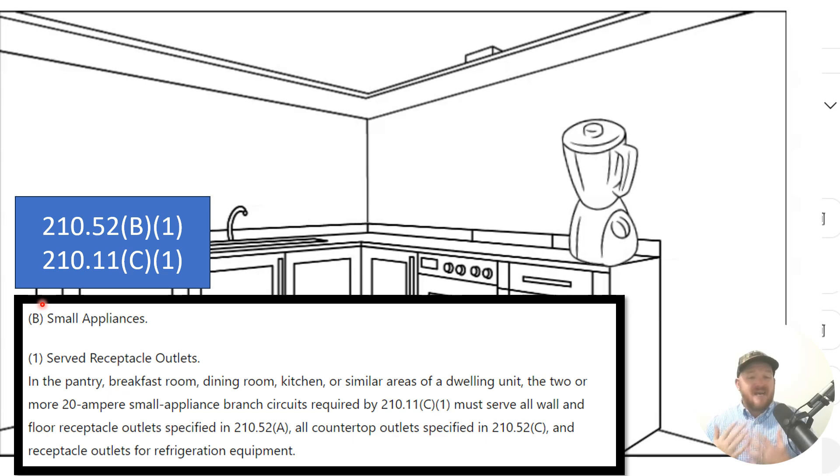I used to pull a dedicated dining room circuit, but it's technically not a dining room circuit — it must be 20 amps and must only serve those areas. It would technically be kitchen circuit three, four, five, six, or seven. For all of those kitchen circuits, we have to be careful in our load calculation section, because each one counts as 1,500 VAs. But that's a lesson for another day.